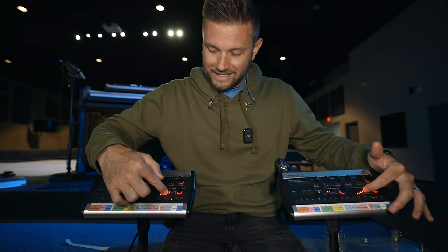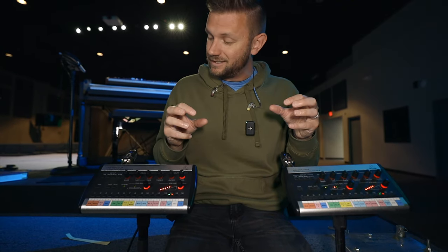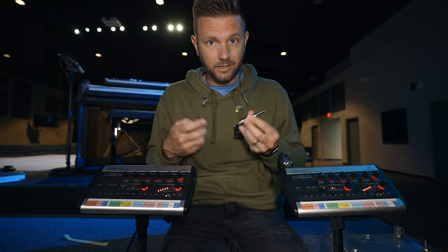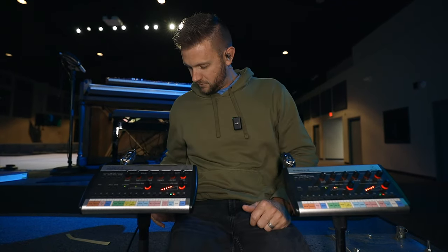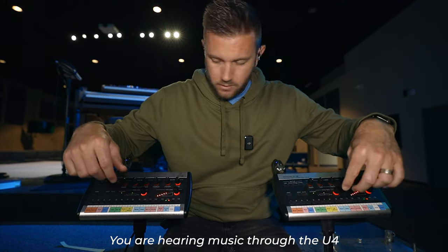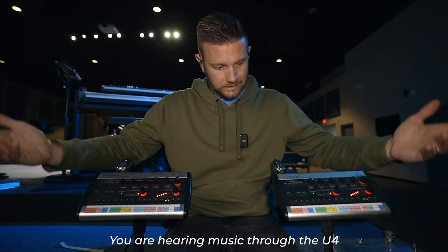On channel 14, the audio levels and output levels are set identical. One thing we're going to test before we get on stage: I want to verify they're not stereo, because the quarter inch to XLR adapter is not TRS, which leads me to believe it's not going to be stereo. I'm going to go to the pan encoder on the P16 and pan it to the left — it got louder in both ears — and to the right — and it's gone. So it is mono.